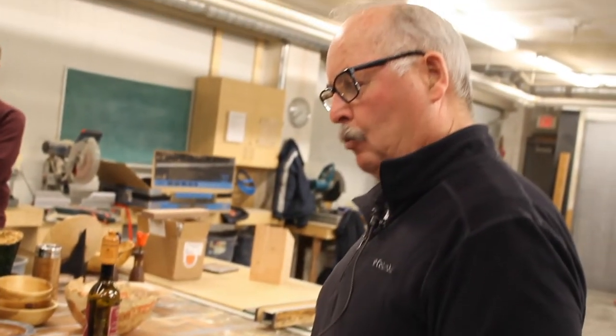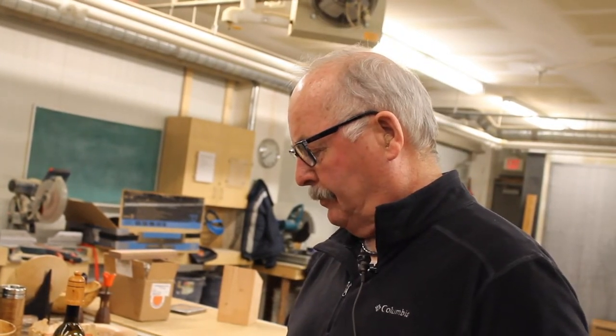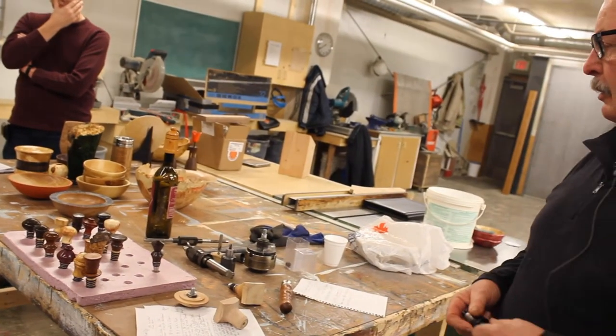This worked pretty good for a while — just stuck it in my lathe. I started having troubles with it wandering out. You're supposed to have a quarter-inch rod going into here, threaded in to hold it in place. But my vacuum system created a problem for that. So I took this to my machinist and he cut it so it can be grabbed by my chuck, and then it's just running in the right spot all the time.